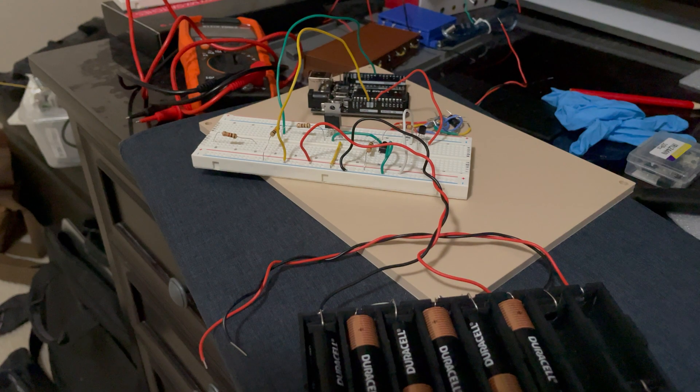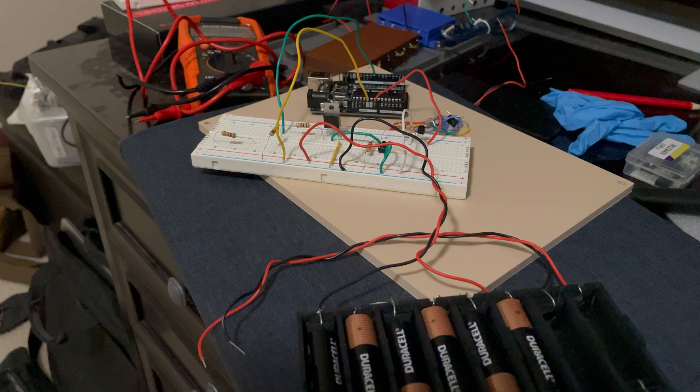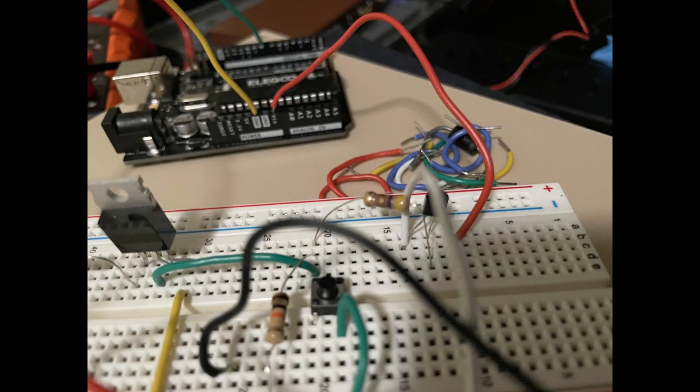However, the circuit got so hot that I couldn't touch the BJT after about 5 to 10 seconds of it being powered on. I tried using different resistor values to try and fix this, and at one point the paint from my base resistor burned off after only about 20 seconds of being powered on. So yes, the circuit does work with BJTs, especially if you have a better BJT selection than me, but if you haven't bought the parts yet or you're not sure of what you're doing, I would recommend using MOSFETs instead.